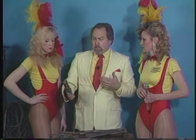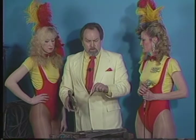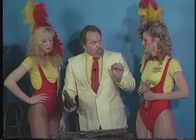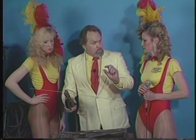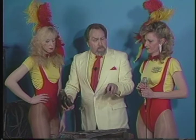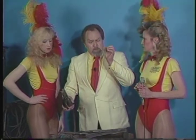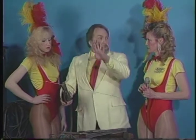So the task in front of the engineer designing these electrodes is, how can we make sure that the electrical energy stays at the weld pocket? What you want to do with the electricity is make sure that it melts the steel right in that area, and that it directs the filler rod into the puddle rather than just literally exploding all over.